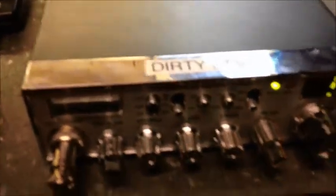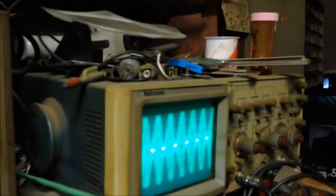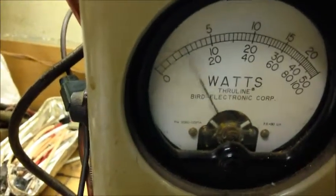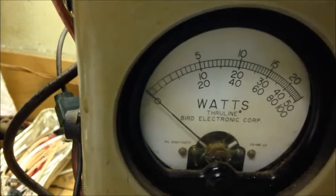Alright, back on Dirty Dog's radio. The variable power is right here on the RF gain, same as his buddy's. I'm going to show you something at the end of this video. Got the scope hooked up — the reference is relatively close. Look at that — a lot better. See the center, the negatives are round instead of going flat across. It's about 225 percent modulation, probably a little more since I didn't calibrate the scope. Looks beautiful. On the 50-watt slug we're reading about 14 on the middle scale.